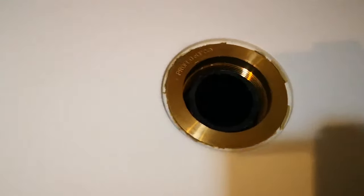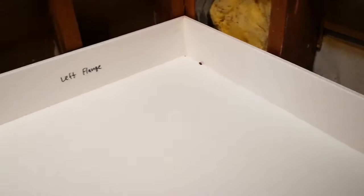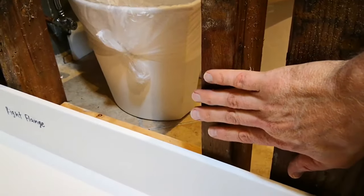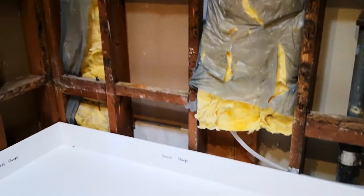It's close to the tile in the front — you'll need to silicone that. You can see where the drain assembly is right around that pipe — perfect. After we're finished doing the install of the shower walls, the plumber will come in and finish installing the drain pipe assembly. You can see how the flange comes up on the wall — that's what creates the watertight seal of the shower pan, so all of that's waterproof inside there. Over here this will be drywall on the walls, coming down to about here — we'll show that in another video. The panels will come down and tie tight to the bottom of the floor. Anyway, we're coming along — the next step is drywall and fabrication of the shower walls.